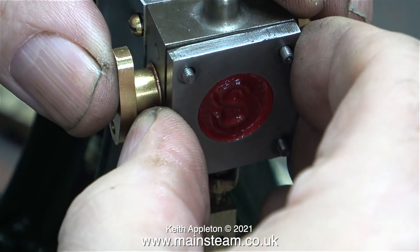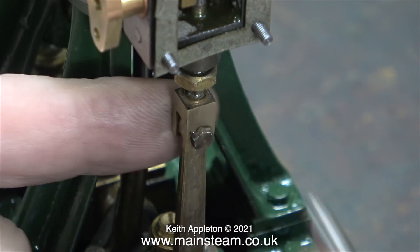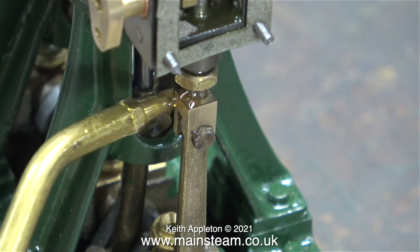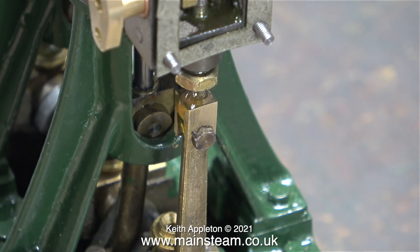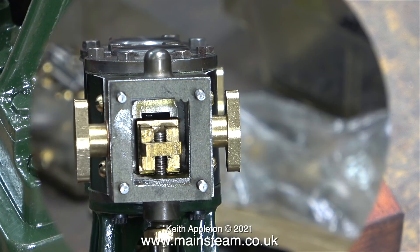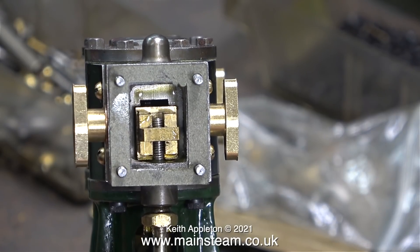I was fiddling around with the camera quite a lot in this sequence, and I actually forgot that I need to set the position of the slide valve so that it works. I've removed the steam chest cover so I can see the valve, and I'm fitting the bolt through to the eccentric rod to the valve fork. This is how I normally set valve timing on a model steam engine. If you look at the eccentric sheave — that's in the foreground with the small grub screw in it — the highest point of the eccentric sheave is at 90 degrees to the crank web or crank pin. With a bit of luck, once I adjust the position of the valve fork, the slide valve will uncover the ports an equal amount at both ends.